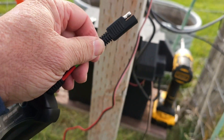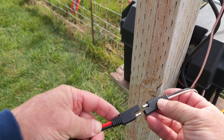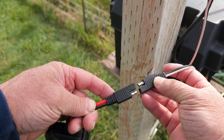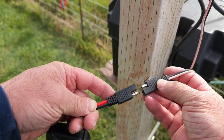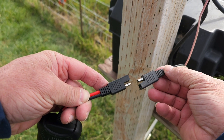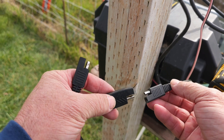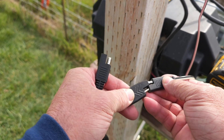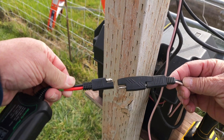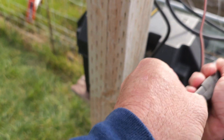Now we'll do the same thing on the battery side. Holding that up and lining them up to check — we are opposite. If I plug this in right now, black would be going to red and red would be going to black, and that'll fry the controller. There are a couple of options: you can either use an adapter like we're going to use today, or you can cut the end off and use one of the pigtails that came in the packaging. I have this little adapter here — these are pretty cheap to pick up. Plugging that in and then connecting the other side, we now have red to red and black to black, so nothing will be screwed up with the system. We'll plug those in and check all connections to make sure things are tight.